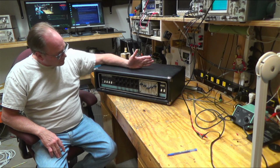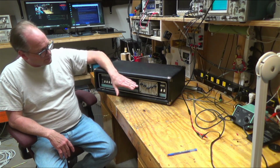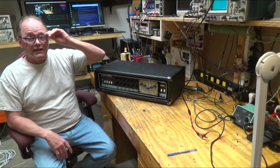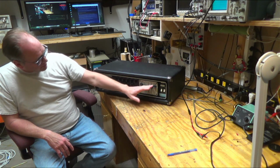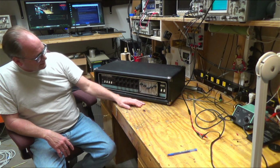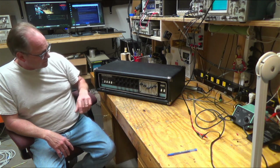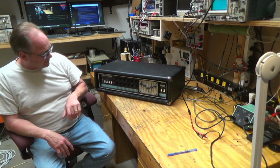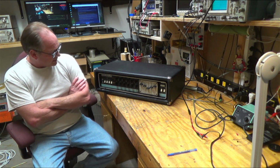One thing to remember with this is that to get that traditional guitar amp sound, the frequency response on it, as we saw, is pretty flat, right? So I think you're going to want your equalizer set more like this to pull that mid-range down. And my son was saying that too. And then use the treble, mid, and bass here to adjust for your particular sound.